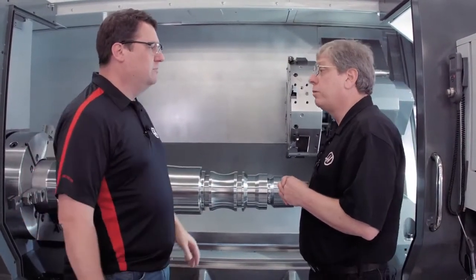John, tell me in simple terms, what is Run Stop Jog Continue? Well, essentially exactly what its name says — you're running the machine, you stop the machine, jog away from the cut, do whatever you need to do, jog back close to where you left off, hit cycle start, and you're right back in the cut. So I'm not actually stopping the program, I'm pausing it? Yeah, exactly.